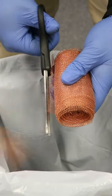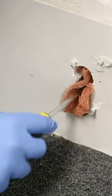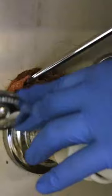Cut the mesh over the trash so the copper fibers don't spread or contaminate sensitive areas. Work the mesh into the opening to create a barrier that pests won't be able to get through. You don't have to completely fill the void, just use enough for a snug fit. Insects won't be able to pass through, and rats will be turned away because of the copper.